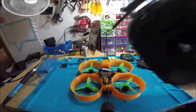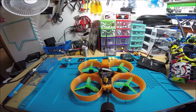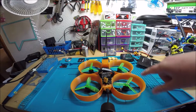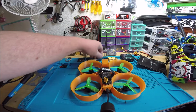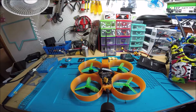And like I said, this top one is ARM, but you can change it to anything you want in Betaflight in the modes tab. You might even be able to do it in the goggles settings. I'm not sure. I know you can change the PIDs in there. I was curious before, I said something about the PIDs in the goggles being different than the Betaflight PIDs. They are for sure, because I went into those PID settings in the goggles, and they all said 0. So it's a totally separate thing. But you can mess around with it.